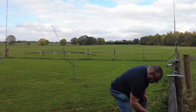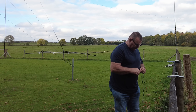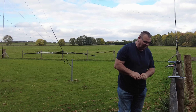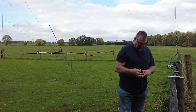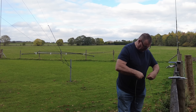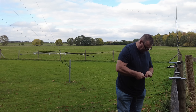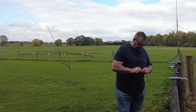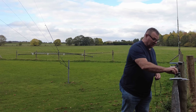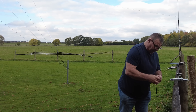A low-to-the-ground dipole — if it's too low you'll get a high SWR. What's actually happening is it'll have low impedance, somewhere around 25 to 30 ohms. Now there is a trick to go from 28 to 50 ohms, and that trick is a pair of 75-ohm quarter-wave matching sections, effectively. That takes 28 ohms exactly to 50 ohms.